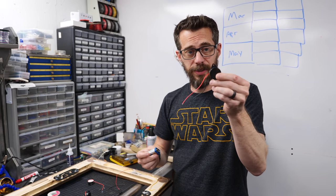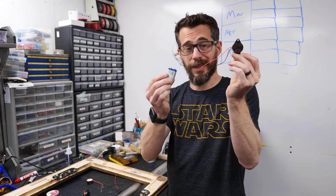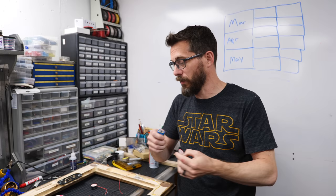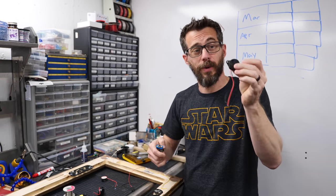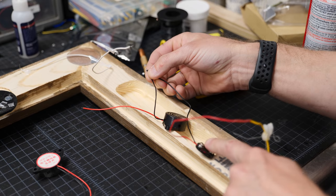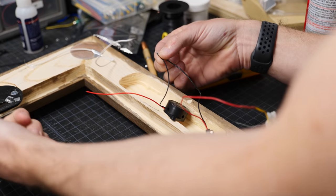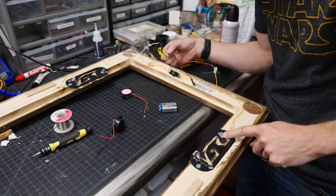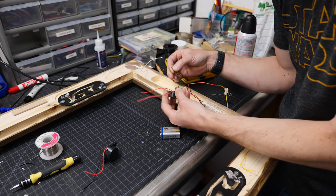What we're going to do is use these little buzzers. This can take from three to 24 volts, so you can use these in lots of different situations. If you take a nine-volt battery and just touch it on there, it buzzes. We're going to make it so that this is only connected if someone is touching both of those posts. We're going to wire up three of these so it's really loud and really annoying. The battery will go here, then the power will run through this buzzer, through the wire, to this side over here. When the connection is made between this side and this side through the posts and the wire, it will buzz. We're going to put three of these all running at the same time.